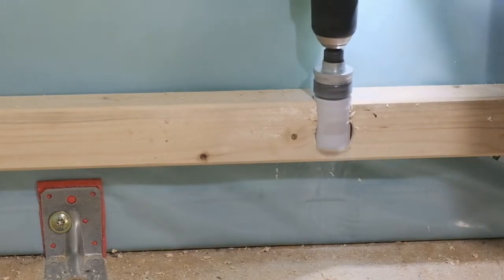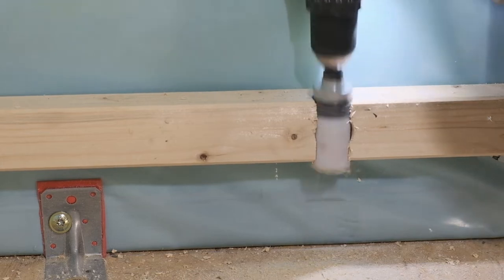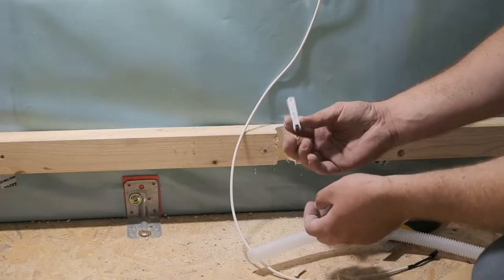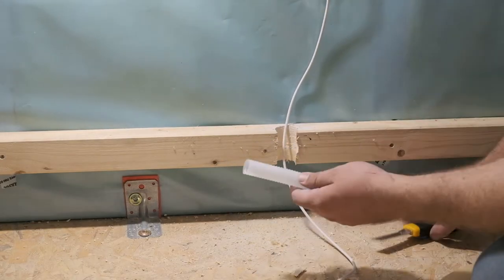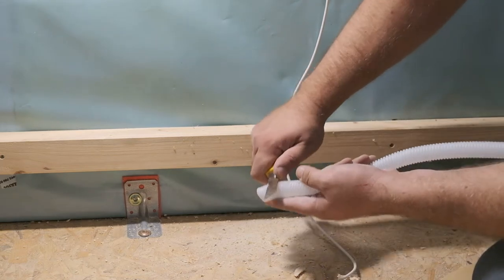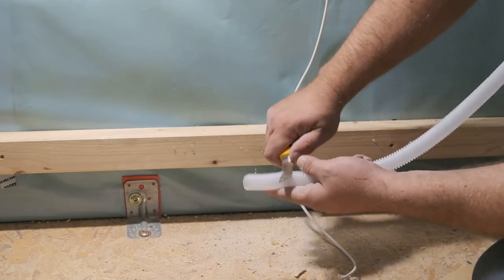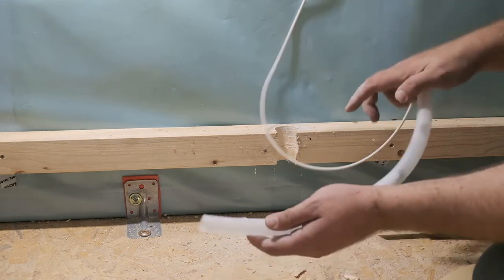Upon placing the sensor in the protector, an air pocket is created around the sensor. This allows us to measure the air in the enclosed floor area even after installing the polystyrene. The protector should be placed in a way that the part with the sensor is installed approximately 3 centimeters above the foundation slab level, while the other part of the protector with the cable should be led into the wall